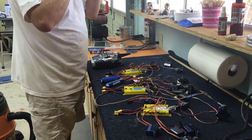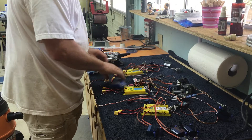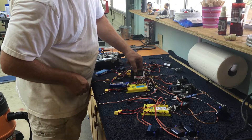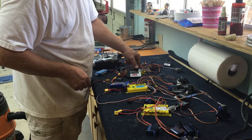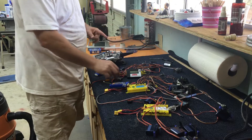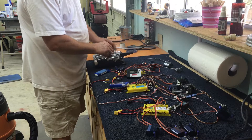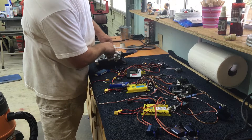It's only 105 degrees out, so I got a little warm going outside. Making up batteries to this panel. Powering it up — 6.21 on the panel, not much voltage drop there. I'll start stroking the servos. I just stroked the servos once. I've got five servos hooked up with the voltage meter. All those servos are good. I can move two, move one right there, but if I move more than one, she'll go down.